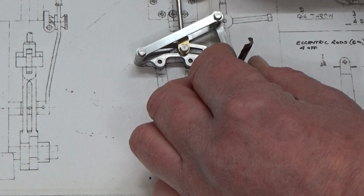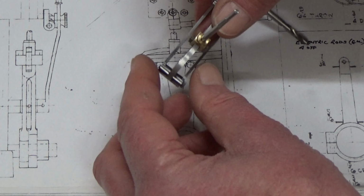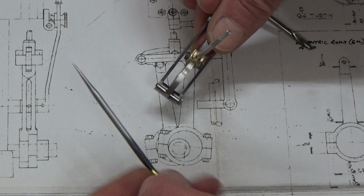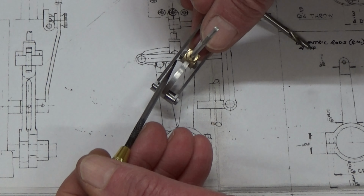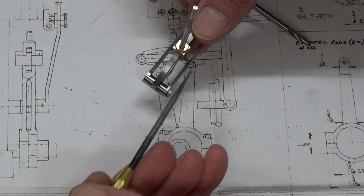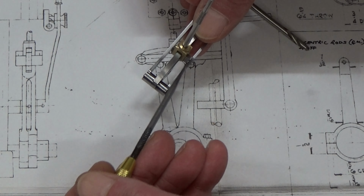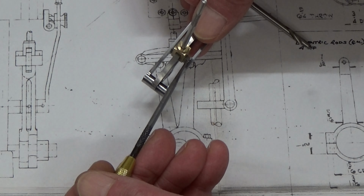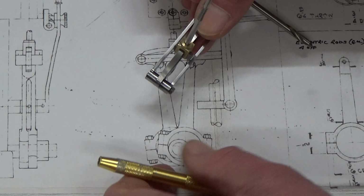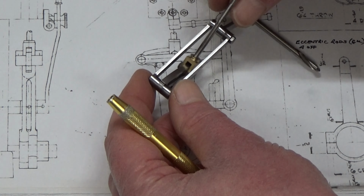Next thing I'm going to do, whilst I'm waiting for the bolts, one other thing, I'll put a half nut on the back of here, because the full nut supplied was scraping against the drag link, and the head of the bolt looks a bit clunky, and it's pretty close to this side, so I'll take a few thou off that and reassemble it, and it should be fine.